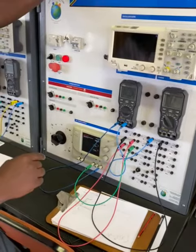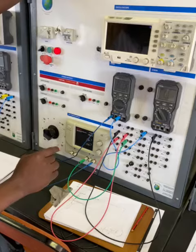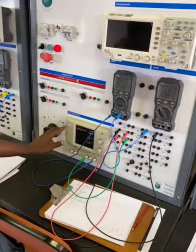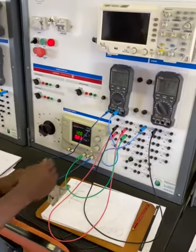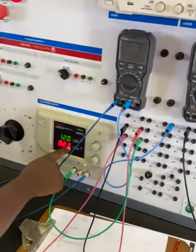So what we have just done here is we have placed our multimeter in series with our circuit. Then we can switch this on. You will see immediately here that we are getting our total current, which we calculated.